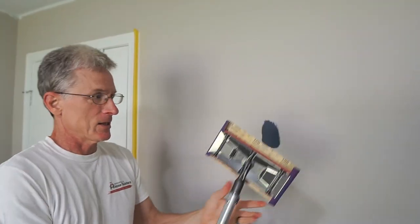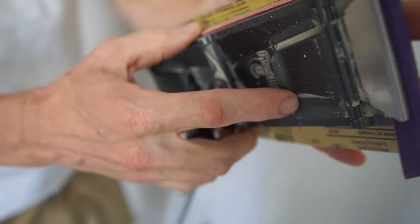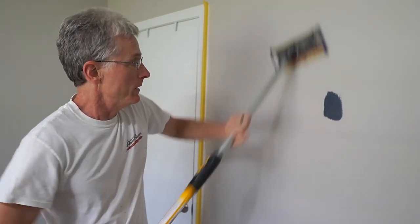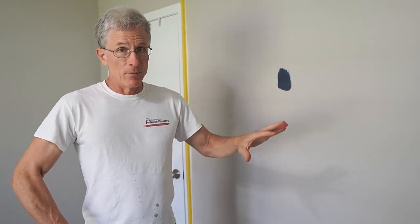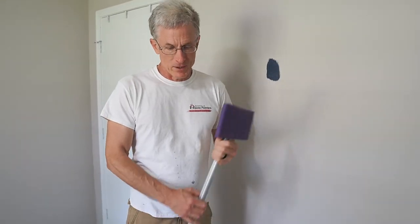I take a sanding foam with a sanding head, cut some sandpaper — 100 grit — and just go down all the walls so we can knock off any bumps from previous paint. That's before we do any drywall repairs at all — sanding is the very first thing. Anything big that's really bad we'll use drywall compound to fix, but sanding off all the walls is that main first step.